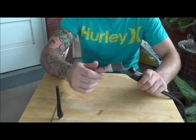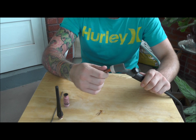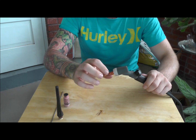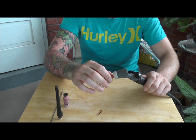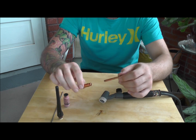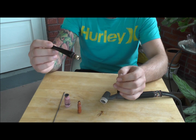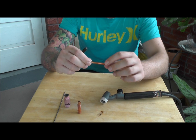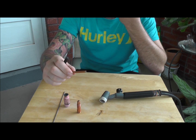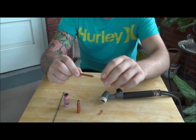I'm going to unscrew the cup. Underneath the cup is the collet body, which holds the collet. The collet body has little holes in the end of it so that your gas can come out and go into the nozzle, and then the nozzle shields your tungsten. The collet, when you twist the tail of the torch down, has little slots that pinch and grab the tungsten — and that's also where your welding current comes through to the tungsten and makes contact.